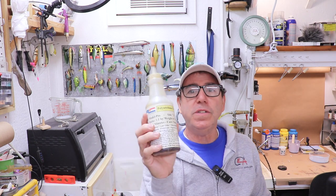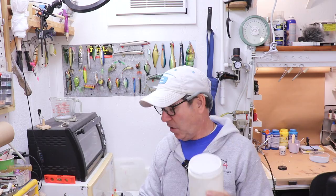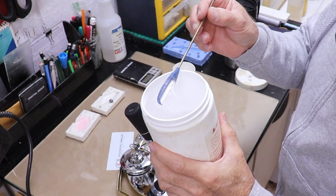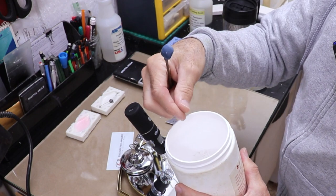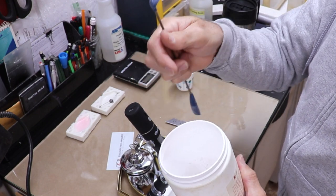What's important to us is that these things are wonderful to add to resin, specifically casting resin. Most of us use polyurethane casting resin — it cures pretty hard and pretty fast and it captures a lot of detail. So why add micro balloons? You can see it has the consistency of cornstarch — it's very fine and even when you rub it between your fingers it doesn't feel very grainy. We use this to extend the casting resin, to increase the volume without adding any significant weight at all.